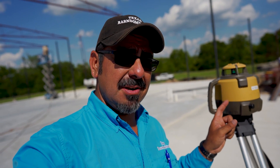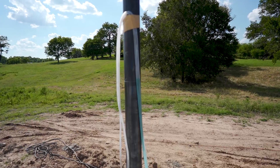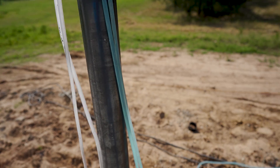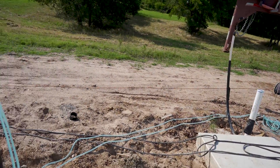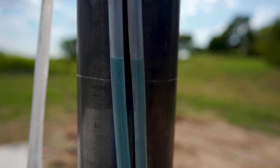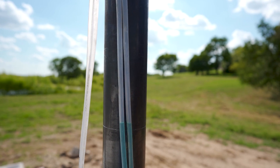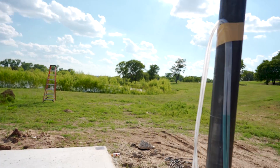Today I'm going to shoot grades with a laser and with a water level and let's see what kind of results we get. In this corner we have the water level. A water level is nothing more than a clear tubing pipe or hose, full of water. This one actually has windshield wiper fluid so that it doesn't freeze in the winter and it's a lot easier to see. Both ends are perfectly level — water always takes its own level, so it doesn't matter if you put it in tubing, a bucket, or even a lake, it's always going to be level.